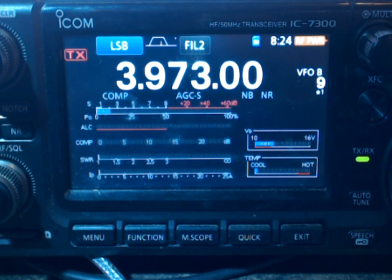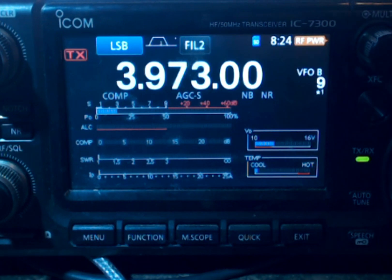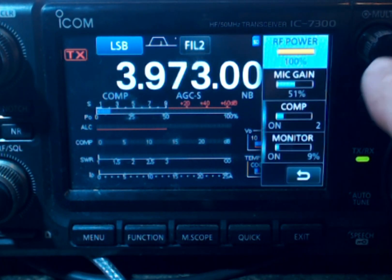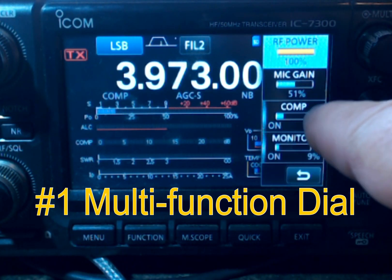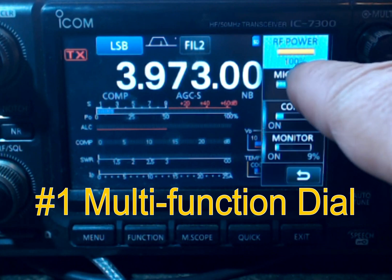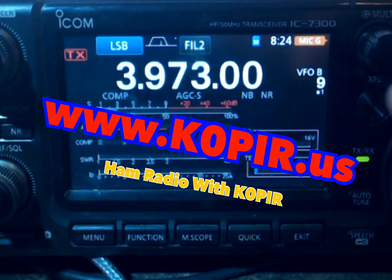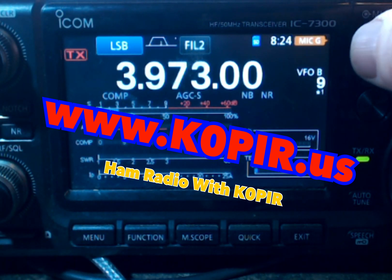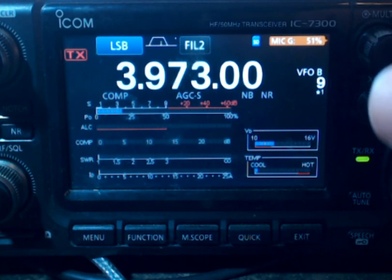It's got some terrific updates, and one thing that I really like is this label up here — RF power. That's what I've got it set for. If you push the multi knob, you'll see the menu come up and you can add anything on there that you want. I've got RF power, but if we wanted to put mic gain in there, just tap and hold and you'll see it changes to mic gain. So now all we have to do is turn the knob — we don't need to go into the menu anymore.